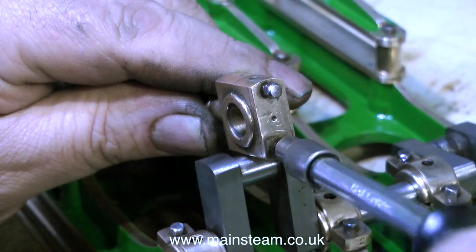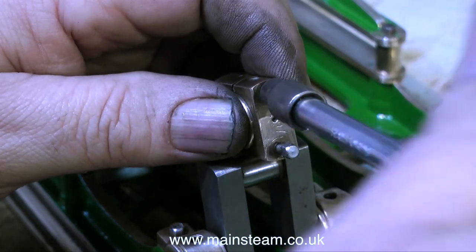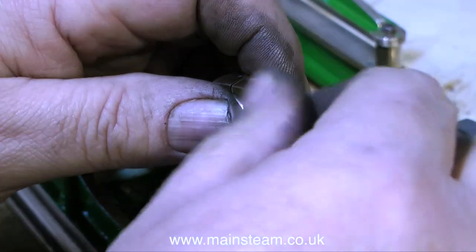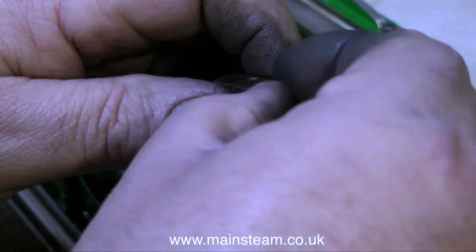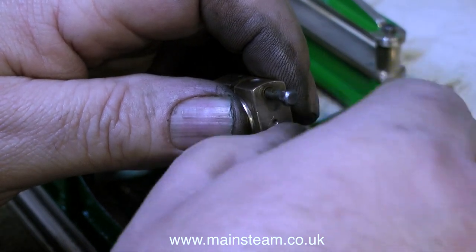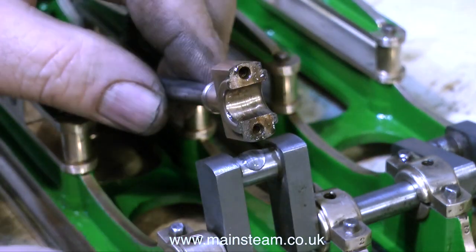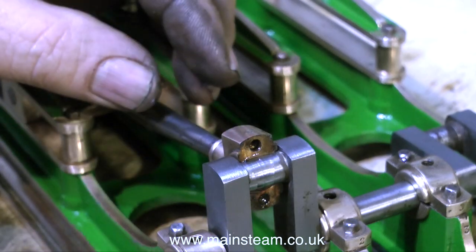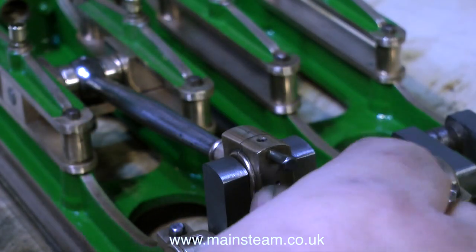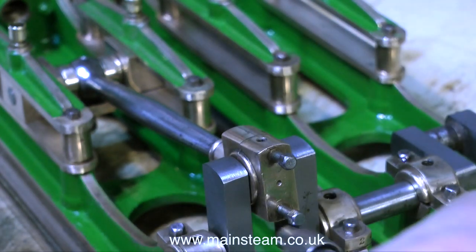Here I'm removing the bolts from one of the big end brasses ready to fit it in position. I've been spending an awful lot of time at the polishing spindle lately — I've even cleaned up the ends of these bolts as you can see here. I've cleaned up most of the engine parts on the polishing spindle; some of these parts were really bad and there has been much grinding and polishing going on. The engine is looking much better now. This clip shows me applying oil to the big end brasses and the bearing surface on the crankshaft — it's very important to make sure that you do not get any dry spots, because if you were to forget and run up the engine when everything was dry, in no time at all both the big end brasses would be damaged as well as the big end bearing.